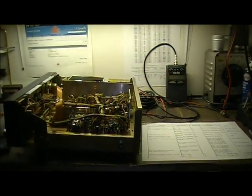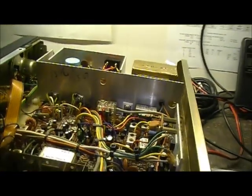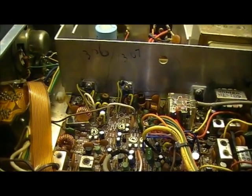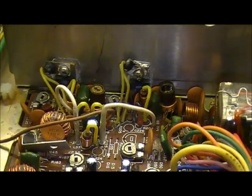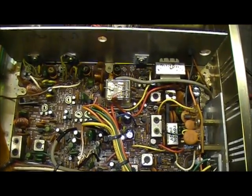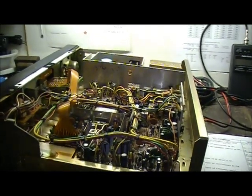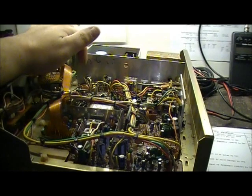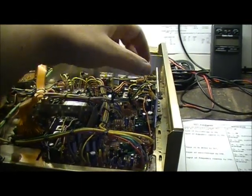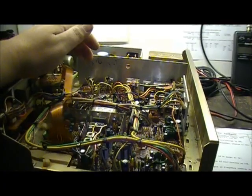Little video on the 458 here and how I made out with the transmitter section. I've went through this a dozen times or more — spent another five hours on it on Saturday and never got any further ahead. This radio just does not want to make the 12 watts. I don't know why. There's a new driver and a new final in this radio. I checked the pre-driver — pre-driver is good, driver and final are brand new. I even replaced the transistors here.